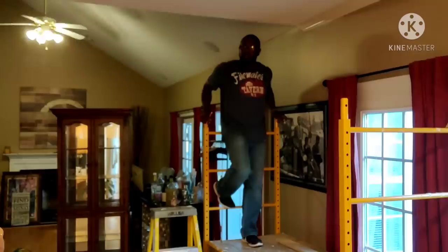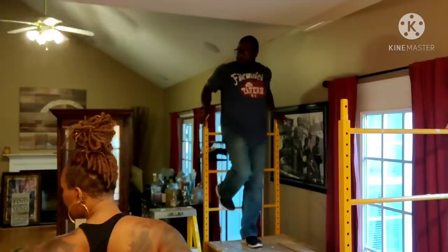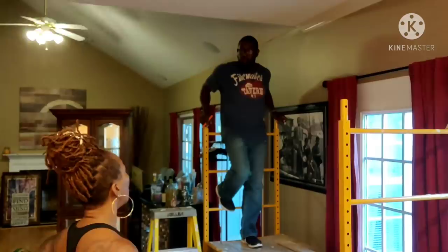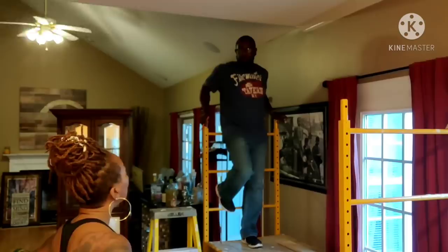Today, I'm thinking we'll finish the crown molding and we'll start the base molding. And we might be able to start painting up here. The crown? So you're gonna paint the crown before you paint the walls? Yeah. Paint the crown before you paint the wall because we ain't gotta be careful. Because then we gotta cut in anyway. It's gonna be sloppy up here, I'm thinking.